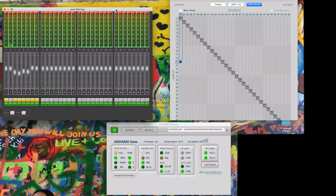We then have our main settings and levels page. You can see things jumping up and down because the drum mics are still connected. The sliders aren't volume — they're gain. These are the input gain controls for each of the individual channels. We then have phantom power on/off and a pad switch on/off. The pad switch is run through a relay — you can hear that kick in. Relays are a much, much better way of controlling attenuation than just a normal electronic control. Relays are nice.